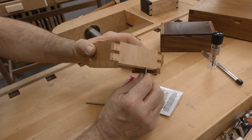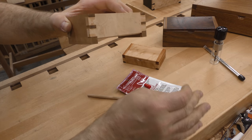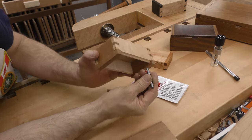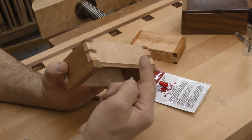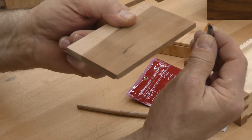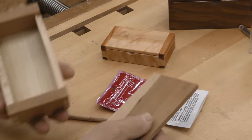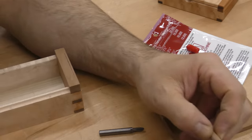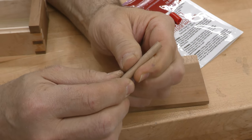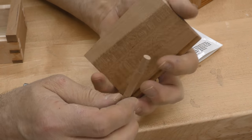You want to make sure this little lip right here comes down around the back side of the curve, and you want less than half of the circle in this direction. Then you take your lid with the exact same setting and run it over the same way — again, a little bit less than half. Now, this is the hinge — made out of a piece of cherry dowel. I make my own dowel; that's all covered in our wood hinge box video. The dowel has to be round. You want a router bit that gives you a true half round so that when the dowel sits in the groove, it makes contact all the way around for a really good glue joint. The problem is that many core box bits are pointed at the top so you don't get that true round shape.